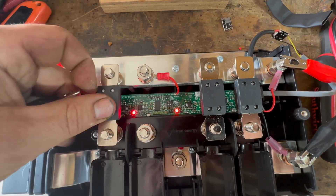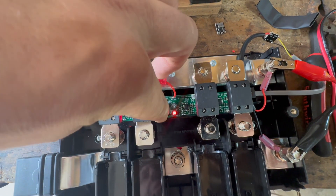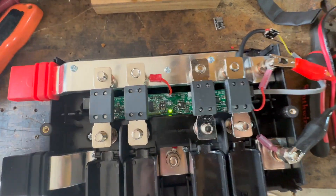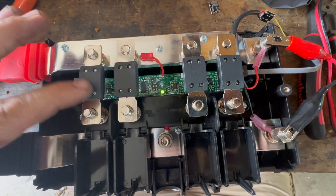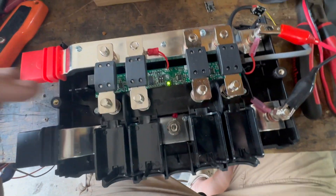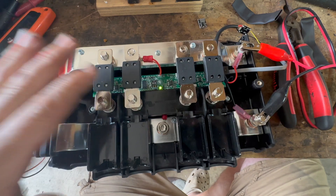That's super helpful because you can't tell visually which one of these fuses is blown. That's also why we always put all the fuses on here even if we're not using all positions, because then it shows green. The other way I think of it is you've got a hot spare — if you absolutely need one, you can take one off. Usually if we do a lot of ANL fuses or something, I'll add a second one right in here, because the worst thing is not being able to find a fuse.